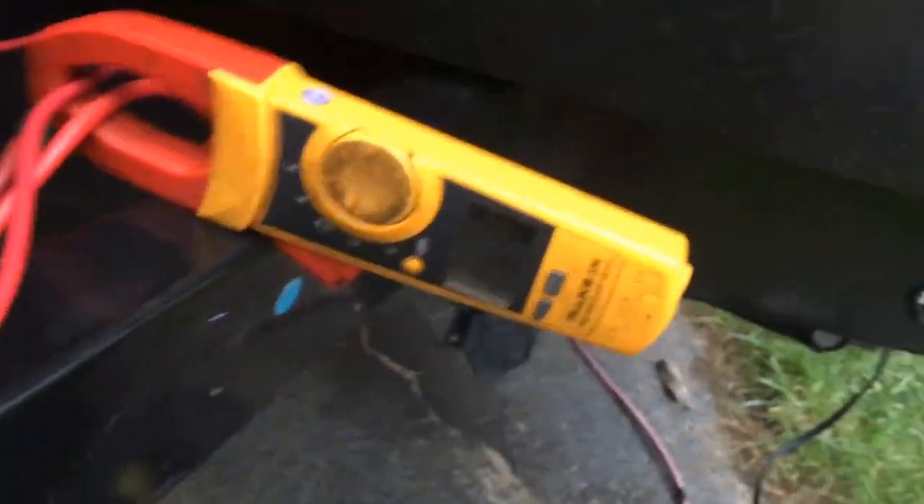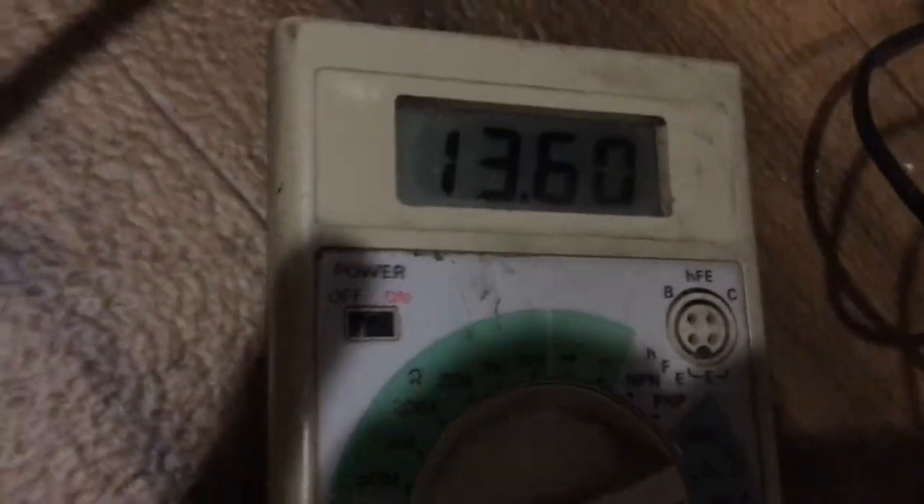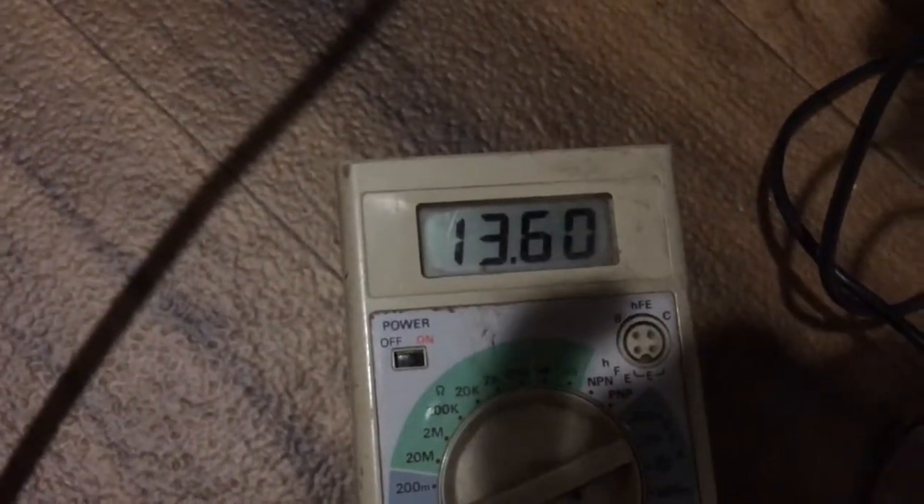64 amps, that's crazy with the added wire. This is my added wire — I added it to the lug. This is number eight gauge, that's number six. The eight actually gets more amps through it individually than the six, probably because there's a breaker on the six. I have no breaker on here.